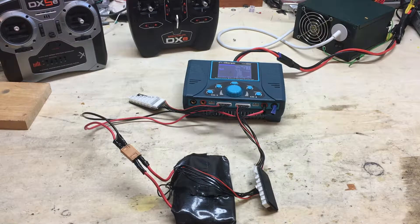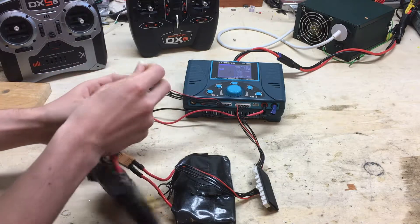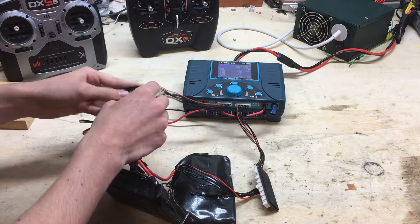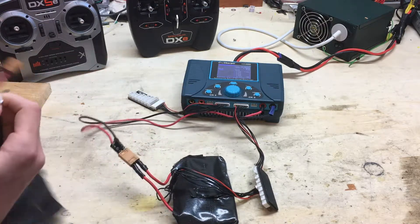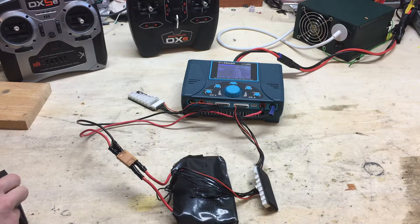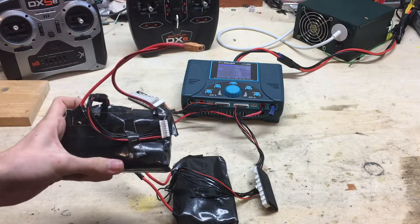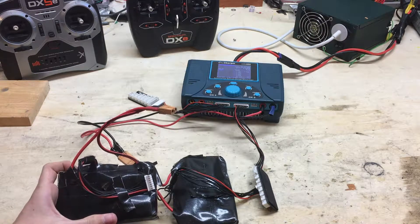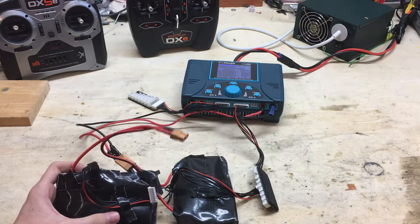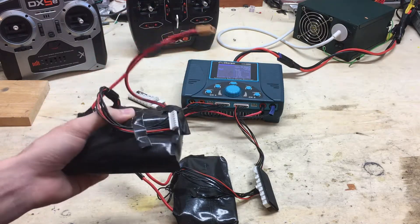I'm gonna get the other battery — let's see how much voltage it has. It's reading 24.945 volts, so it's at nominal voltage. I'm going to plug this into the robot and do a combined weapon and drive test to see how low the voltage drops after three minutes.